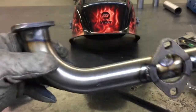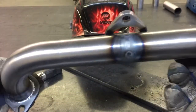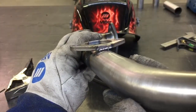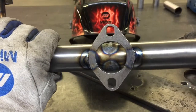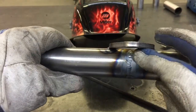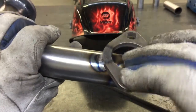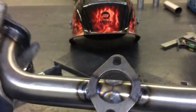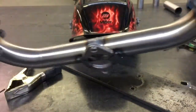That's all I'm going to get done for today. These are welded up complete on both ends and I've got it tacked on both sides of this flange. What I'll do now is come back and heat this up with a torch and open it up a little bit, and that'll allow me to spread it open to fill in this gap with the pipe and not a bunch of weld. Then I'll come back and finish my weld around both sides of that, clean up the hole, and finish my fitting for the carb heat.